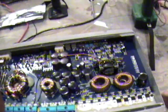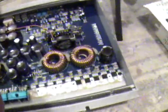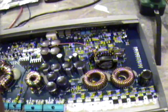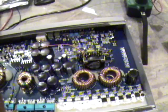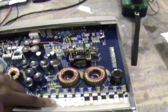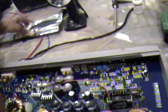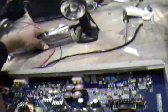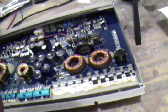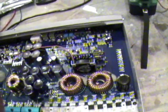If I wanted to repair this amp, I would replace those five bad transistors and this amp would be almost as good as new — it would work just like it did the day you purchased it. That's probably what a repair person would do too. However, since this is my amp and I want it just like it's off the showroom floor, I'm also going to remove the other five transistors and replace them all, because you want all transistors to come from the same lot. If they're not identical, they'll handle varying quantities of the load, and the ones that take the most abuse will fail faster.